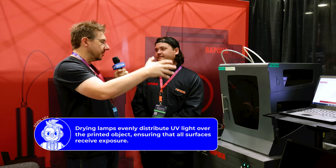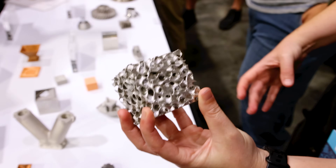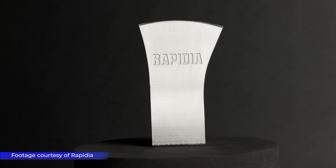Now there are finished parts out of the sintering oven — they look great. The reason to choose a 3D printed metal part from metal paste over powder bed fusion or milling comes down to price point and facility requirements. Powder bed fusion can get quite expensive, with all the PPE and high power requirements. The Conflux 1 runs on standard three-phase electrical or even a home dryer plug — they've done installs at homes. It's dead easy to use: if you're familiar with FFF 3D printing with PLA, you can pick up this machine in about a day and be off making green metal parts, with sintered final parts ready the next day.